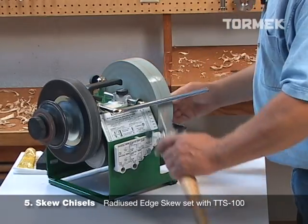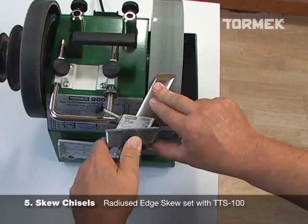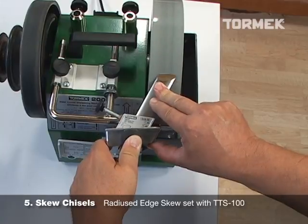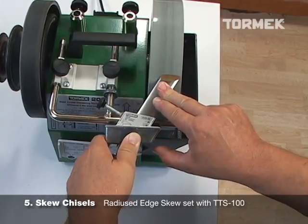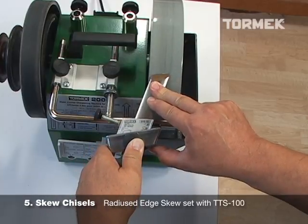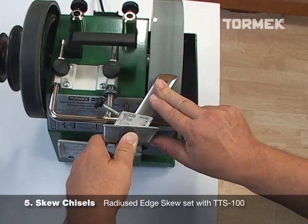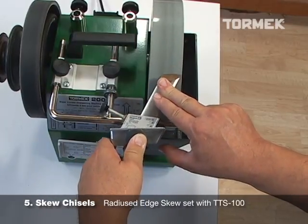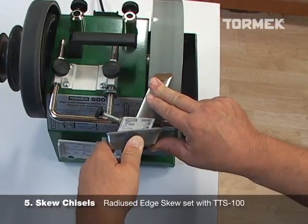Start the Tormek and use the pointed corner of the SVS 50 body as a pivot point to create the curve. The arc is not very wide or exaggerated. Don't pivot so far that the closed seat falls off the universal support. Vary your position on the grindstone to minimize stone wear, and keep the stone active using the SP650 stone grader.